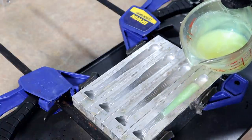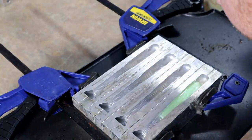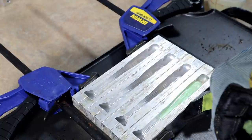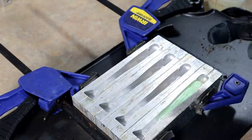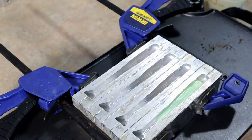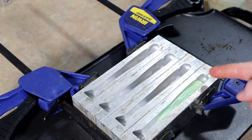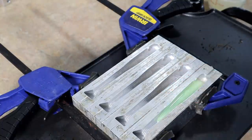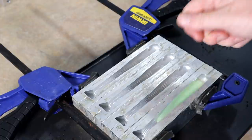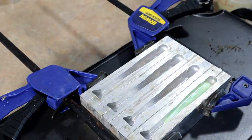Just let the plastic flow. You can also blow on it to stop it where you want it — that'll help set it up. Look, it just cleared the tail section; you can see that green just float over that white pearl belly. Now I have that middle vein color exactly where I want it — stopped right there in the eye socket and just beyond that bottom color. That is what I consider a perfect vein pour. They don't always work out that well even with experience, but now we're ready for the top color.